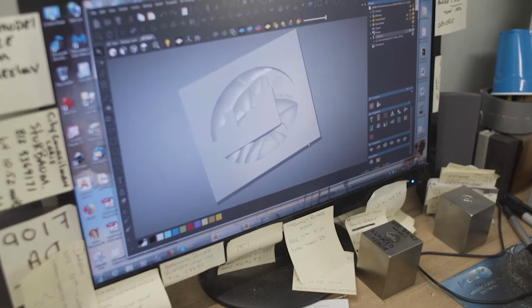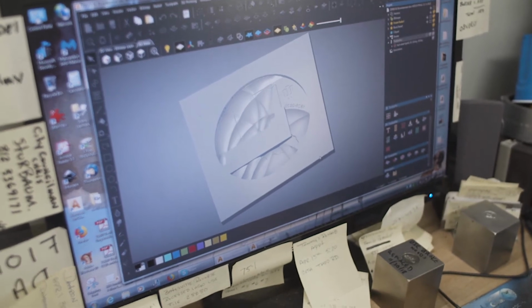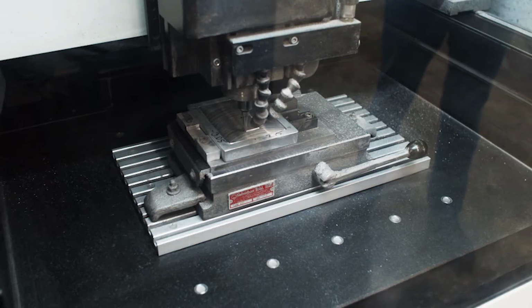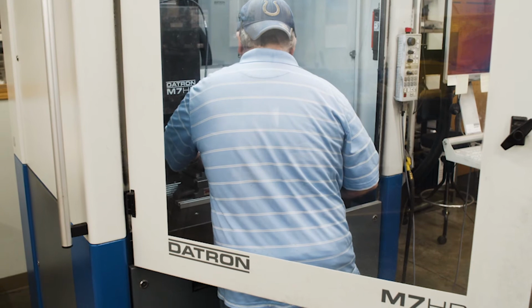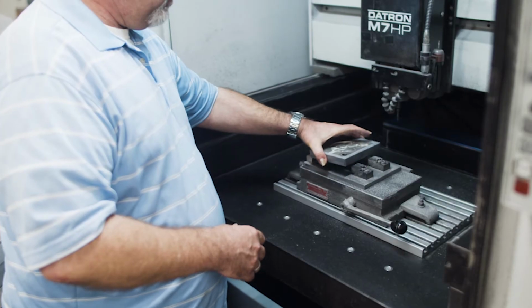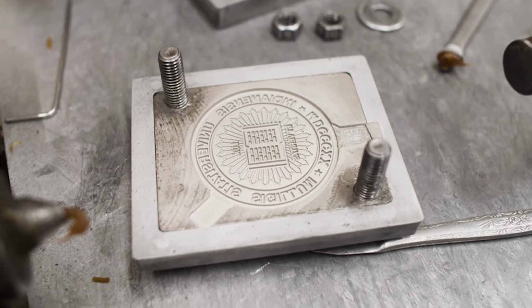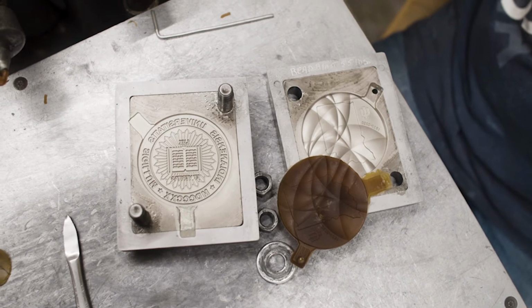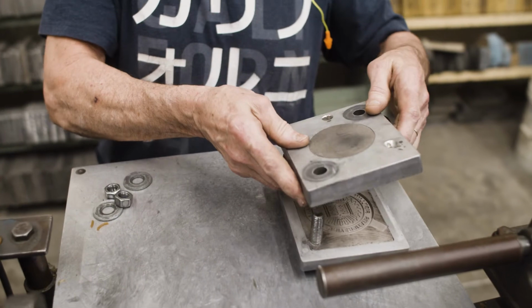We began the process with receiving digital designs from Jeeyea, the selected artist. We worked with Jeeyea to develop levels and sizes for each of the components of the medallion. Digital files were then introduced to our milling CAD program and then transferred to our CNC machine for milling. They're two-part dies, and we use that for wax injection. We're injecting waxes under high pressure into these metal dies.